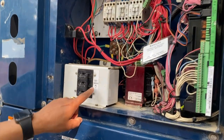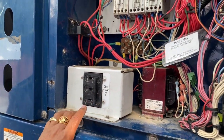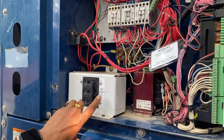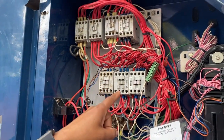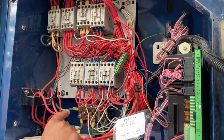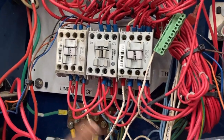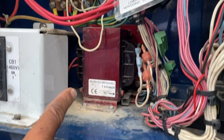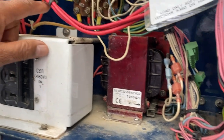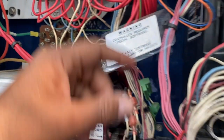You can see the main breaker, CB1. How much is the voltage? 460 volts. Your ship will also have something like 440 or 460 or whatever it is. Then you have different contactors — you can see the line, CF. And this is a transformer. Different, different loads. And you have the main transformer. Here is earthing. These are all earthing. And this is the controller.